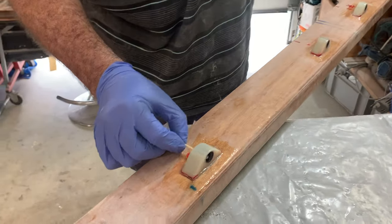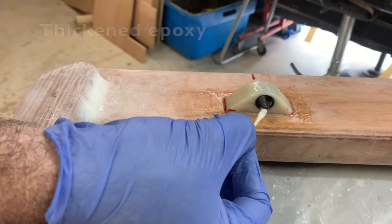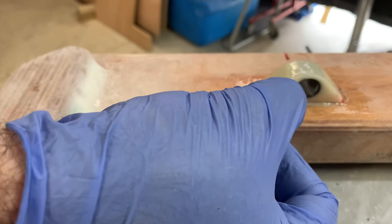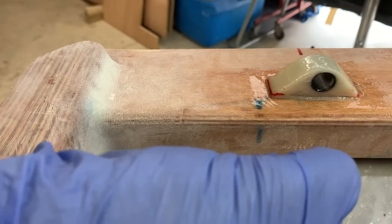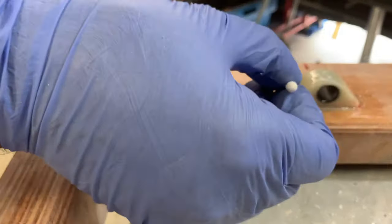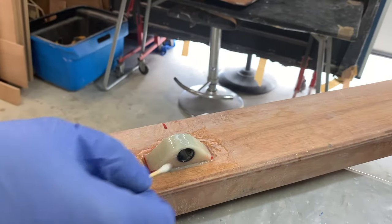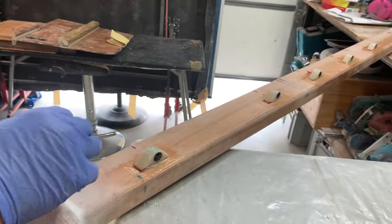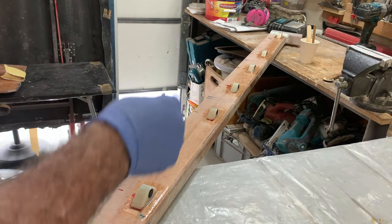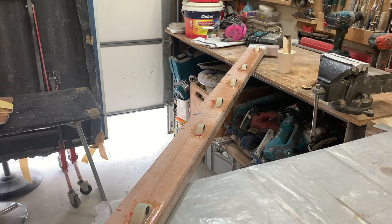Right, so we've made up these little lugs out of some glue. And we've taken a little bit of black poly pipe, stuck it inside a mold, and filled it with glue. It's basically like a piece of angle iron, and then we've sliced them, and we're gluing these into several different places for several different uses. This is along the gutter at the back of a hinge plate, and there's going to be a cable run coming along, so it'll give us a place to zip tie our cables to. Right, let's get a move on and assemble these lockers.